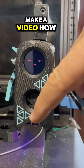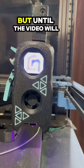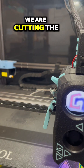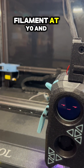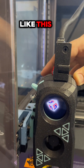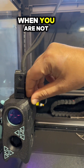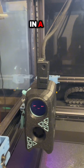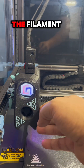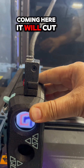Hope you liked this update and I'll make a video on how to set up the cutter. But until that video is ready: we are cutting the filament at Y zero and X zero. You can go to X zero when you are not at Y zero — it will touch the blade but it will not cut the filament. But when you come to Y zero as well, it will cut the filament.